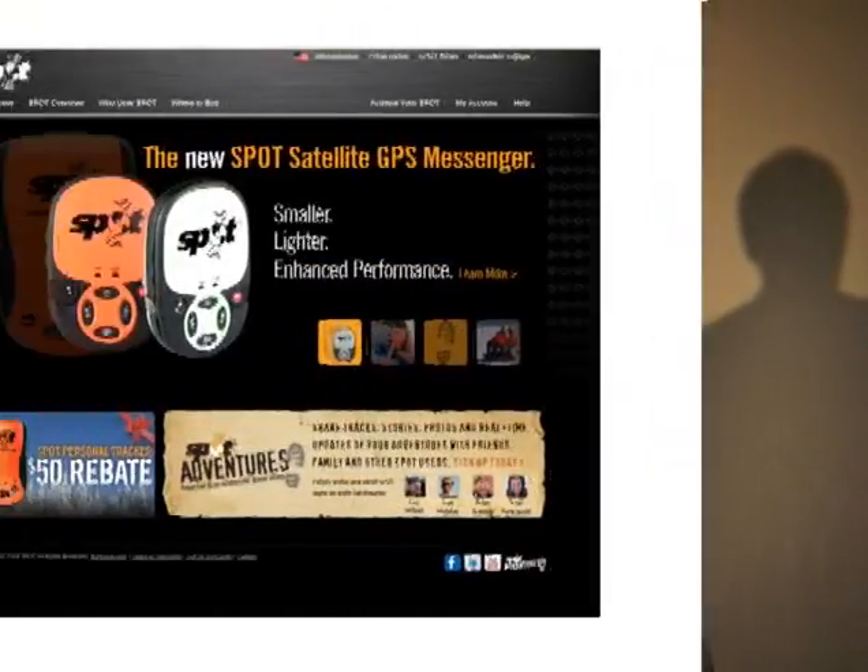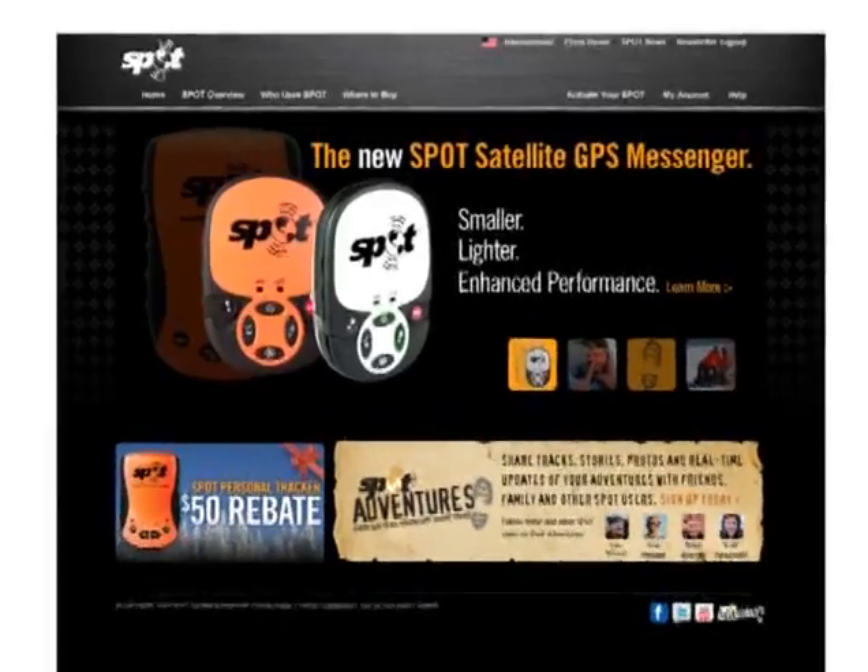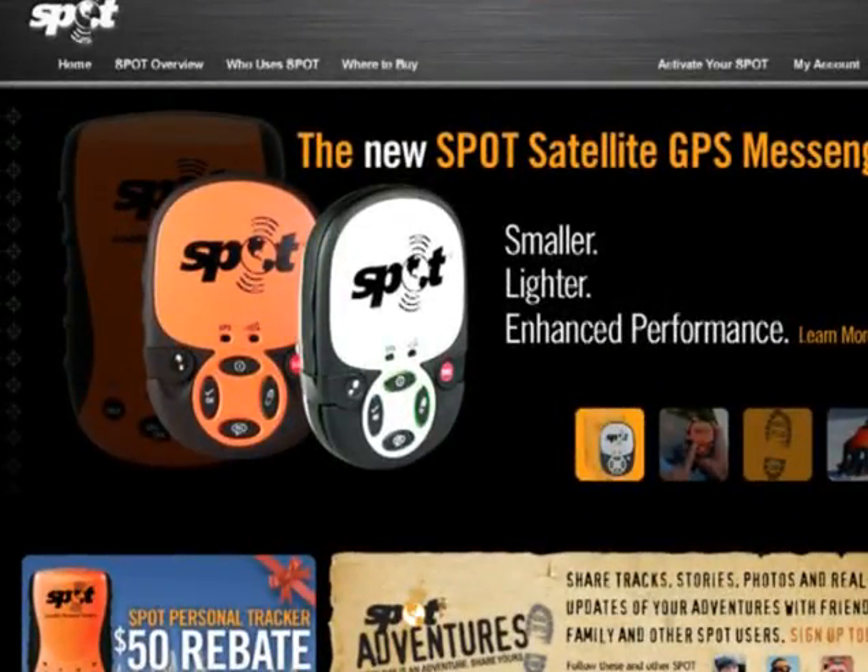How do I get the data back from a balloon over the ocean? A satellite transponder is very pricey — I looked into it. It was $1,000 for the unit and $1 per transmission. However, recently there has been a unit called the Find Me Spot. It's a little orange unit designed for hikers. It has a GPS receiver and transmits directly to the Global Star satellite network. It'll be lying upside down in the mud and still get a signal up and show up on a map. Unfortunately, it only transmits every 10 minutes. You do have to buy a subscription service — about $100 a year — and the unit itself costs $150.